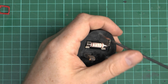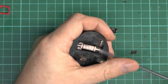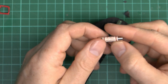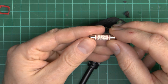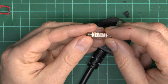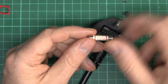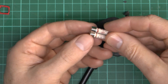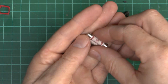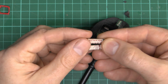This was a kettle, 2.5kW, so you'd expect this to be a 13A fuse - it certainly wouldn't work for long if it was a smaller value. Let's pry this out and see what brand we have. It's an Asia fuse, 13A of course, with all the usual markings, and it claims to be BS1362. Yet another mystery brand. Compared to the other fuse it's pretty much identical in external appearance, but then of course they should be. So Seman and Asia fuse - whoever they might be.